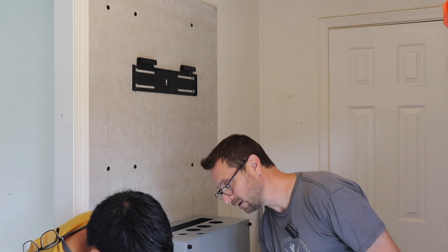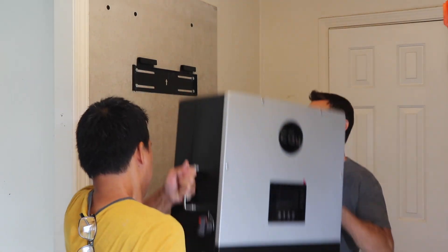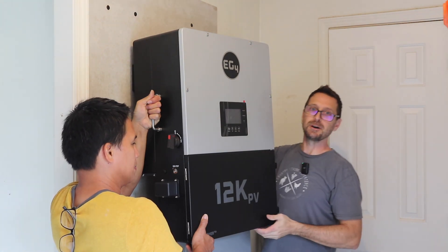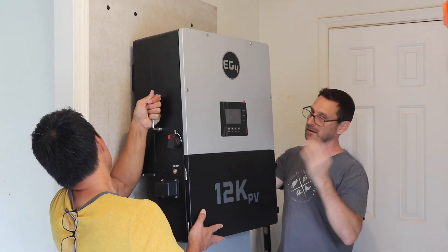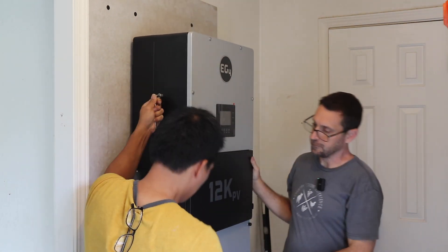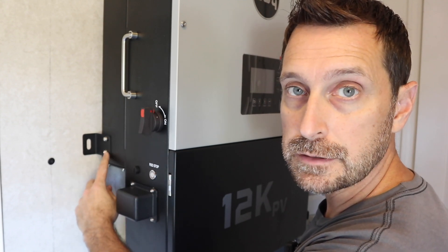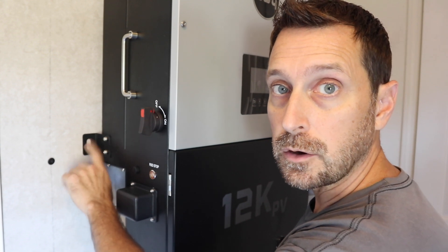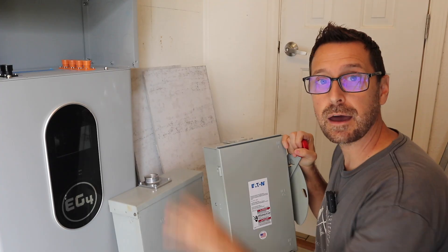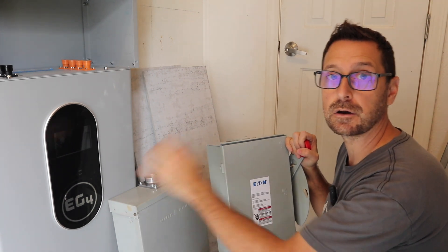All right, now we're going to hang this 12k on the wall. It needs two people — I've only seen one person ever lift this up by himself. We're going to get it on top of the conduit box first. Make sure your bracket on the wall has an arrow facing up. Earlier in the video I had it upside down, so now it's the correct way. These little brackets for the 12k connect down here and also go into the wall with a lag screw. Now that we have our battery and our 12k in place we're going to put some more hardy backer on the wall to go behind our critical loads panel and our transfer switch and then get these up on the wall.